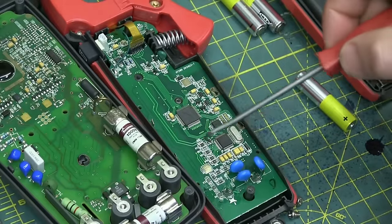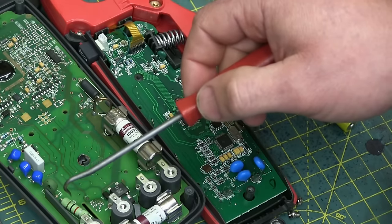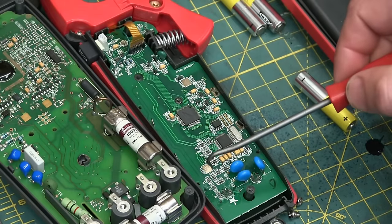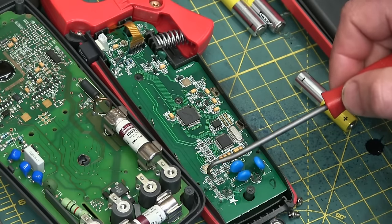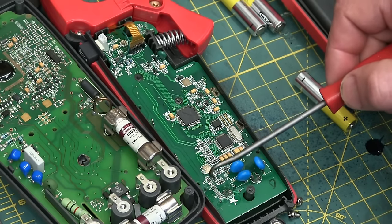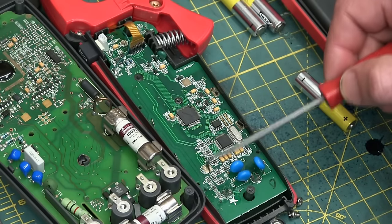If we look at the topology, it's very similar. We have a big resistor here — this is your input impedance — and then some transient voltage suppression. Far more skookum in this one than in that one, but essentially the same thing. We add a whole bunch of surface mount resistors, and you might wonder why they don't just use one of the correct value. I learned in a previous video's comments that the reason is for creepage isolation. There's no isolation slot here, but by adding these distances together they get the isolation they need.